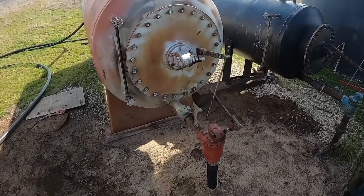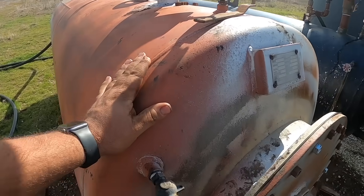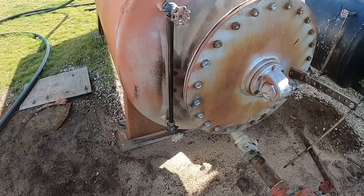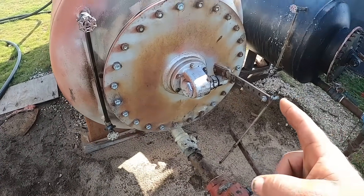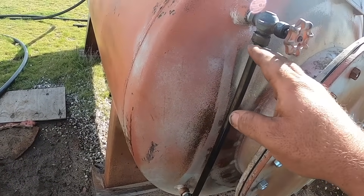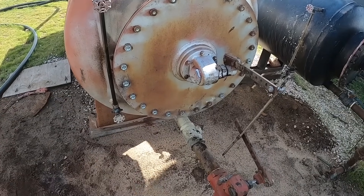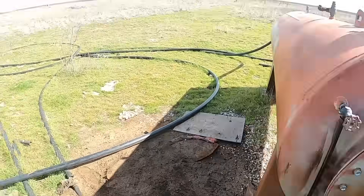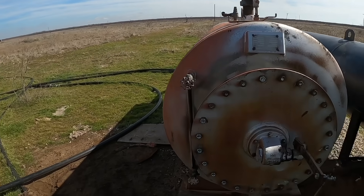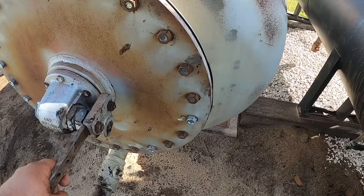Well tubers, while we're here on the new lease, we've got a little bit of a problem to work on. We've got a problem with my oil and water separator. I've explained how these work before, I've got a couple of videos on them, I'll try to link them in the description. The water-oil level should be roughly in the middle, and this one is all the way full of oil. That means it's probably pushing at least a little bit of oil through the water side all the way over to my water tank, and we don't want that because it'll eventually get pumped back into the ground. That's certainly a waste of money to throw away what you produce.